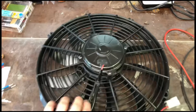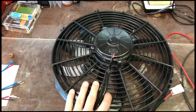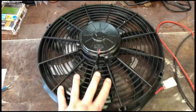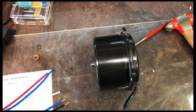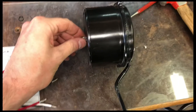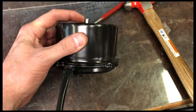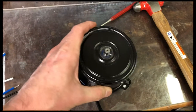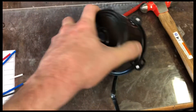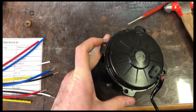This is just kind of a for-fun teardown. We're going to get the motor open and see what went wrong inside because I'm pretty curious - it sounds to me like it's got a broken brush. To say that this thing is not serviceable would be an understatement. Pretty tight press fit even after taking the lock ring and c-clip off. I had to beat it so much to get it off, so obviously it's not designed to ever come apart. I drilled out the rivets that are integral to the brush cap.